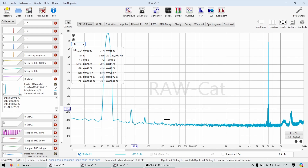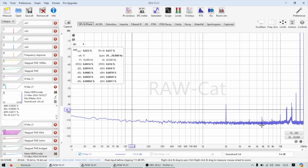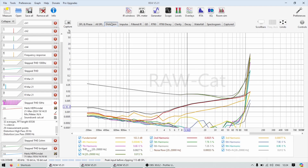The intermodulation distortion is very clean — much cleaner than the five-channel. This is more important for lower frequencies, and it's very nice to see how clean it is at the bottom end. Higher frequencies are not as clean, but it doesn't matter for a mid-bass amplifier. Multi-tone looks good — gives us 15 bits, slightly less than the five-channel, but perfectly fine. I also tested it with a 50 Hz tone to see how it performs on lower frequencies, since I might bridge it for a front subwoofer.